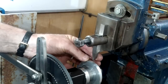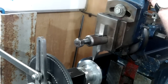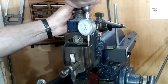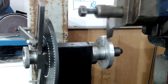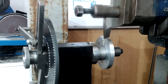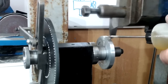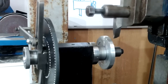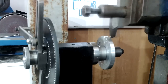Turning my attention to the cutter, it's difficult looking at a gear to determine what the pressure angle is. The tool you see now is set to 14.5 degree PA, pressure angle, and this was pure guesswork, to be honest, and the flat at the bottom of the tool is 1.6 millimeters wide. It roughly fits inside one of the teeth on my 50-tooth gear. To be honest, the gear was made in China, so for all I know somebody could have sat there at a bench and filed it to shape. Who knows?